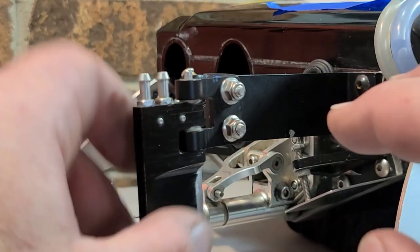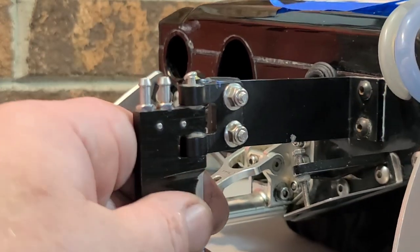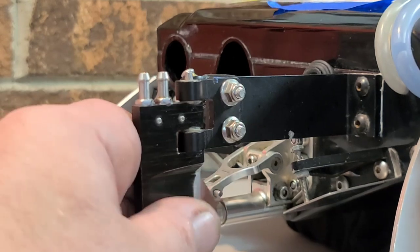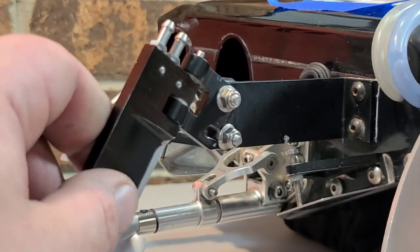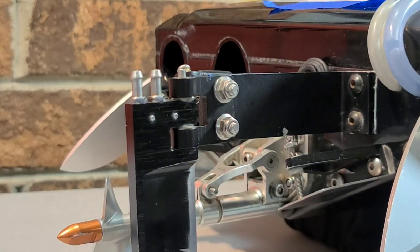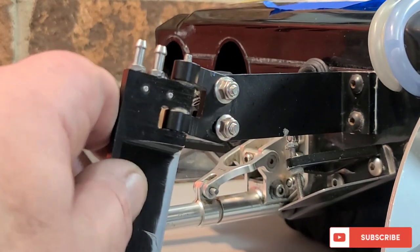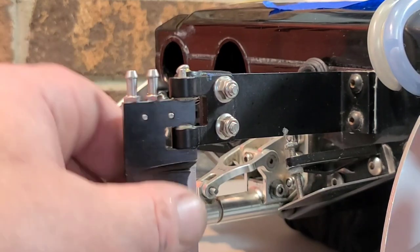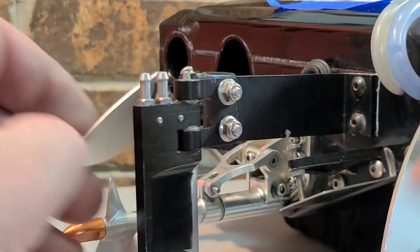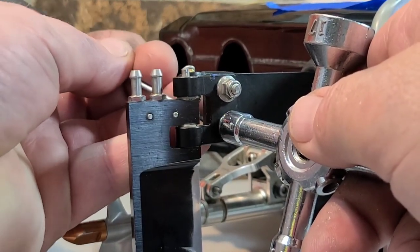I got it installed back on the boat. I'm using a four millimeter screw with a four millimeter larger nut, just cinch it down. You're definitely going to need to put loctite on it so your screws don't back out and they'll stay at the same tightness. When you hit something, boom — it's going to kick up for you. Push your nut from the other side and slide your rudder blade back in — done. That's iron clad! I think we could do this to the Vellez and the U19's rudder too — they're designed a little differently but it should work. You just notch it out, tighten it down, get the right pressure so it won't kick up just from running the boat.